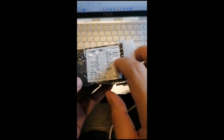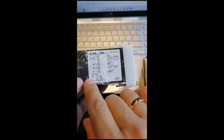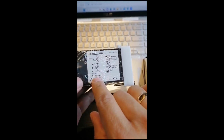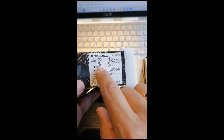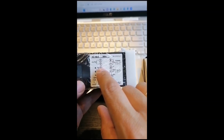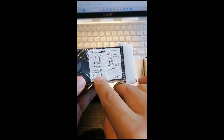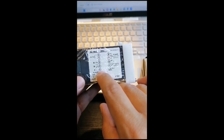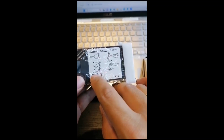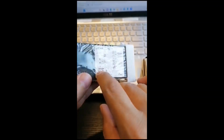You can use the output of that transmitter here, which is going to be on terminal 4, positive, and terminal 2, which is negative. From here also, I see this one. Milliamps input will be 5 and 3. 5 is positive, 3 is negative. As per this one.